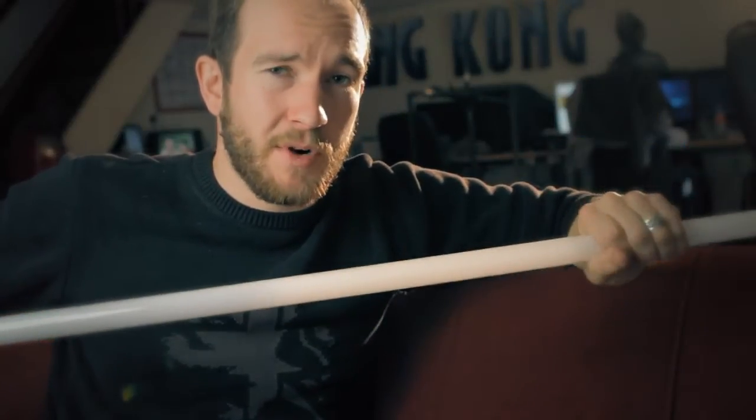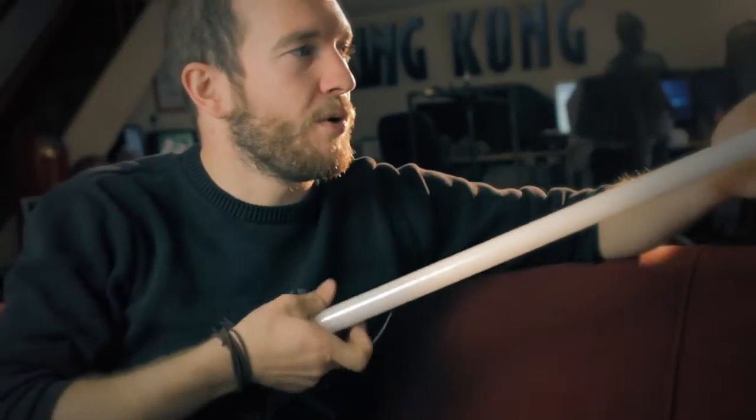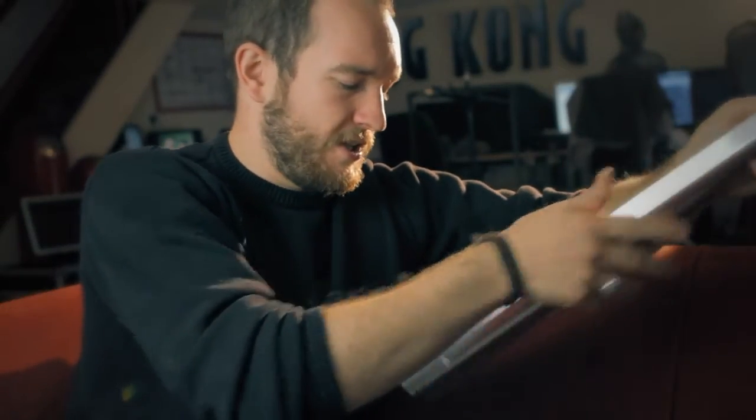Fluorescent tubes are inherently glass and very fragile. They're also filled with quite nasty gases, so you don't want to break them. You can get polycarbonate housings to toughen them up, but it's an added expense, and you've still essentially got nasty gas and glass inside. The other problem is that because they emit light in 360 degrees, you generally want it all to go in one direction. So you take a highly reflective piece of material, clip it onto your light, and all that light is caught and bounced back — but that's a bit of a faff. And of course these require mains electricity, which you don't generally want to mix with water.